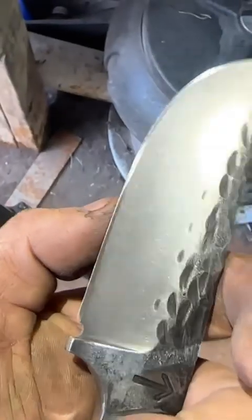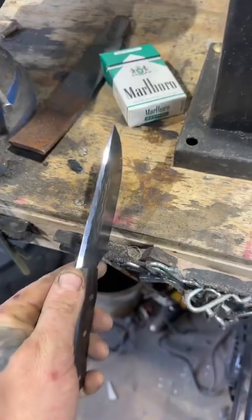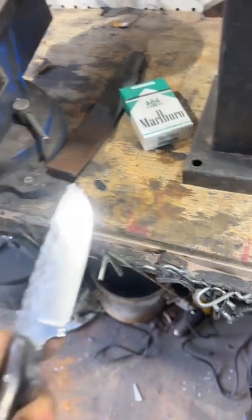As you're sharpening, you'll start to notice a little bit of a wire burr on the edge begin to form. That's what we want. We want that burr to go the entire length of the edge. Now that we've got that, we're going to take off the burr using the corner of my table. I just slide it over the edge to get it off. Now this is already fairly sharp, but I like them ridiculously sharp. If you can't shave your face with it, it's not a knife.